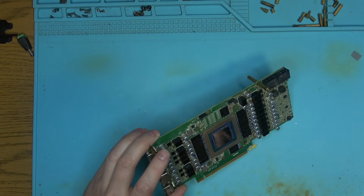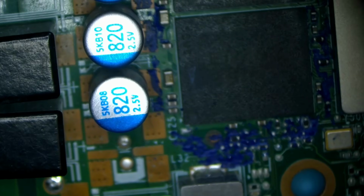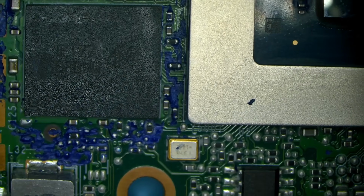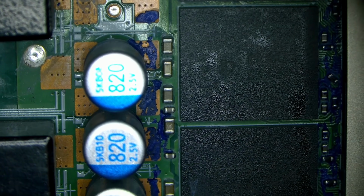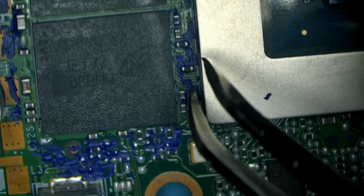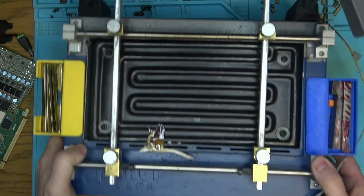So what I'm going to do now is I'm going to take a quick look around that particular chip and kind of wonder, what if we have an issue with a solder joint on any of them resistors that are nearby? And that would be it. But I don't think so. I think all this is just a little liquid moly or whatever. No, that's oil. Liquid metal that got under, and we just can't see it. Take the core out, take out that chip and see how well that flux will do.